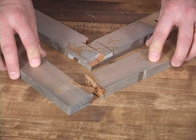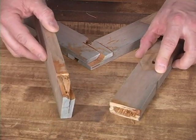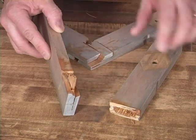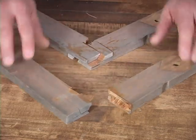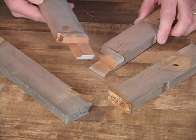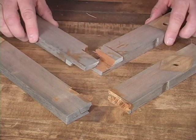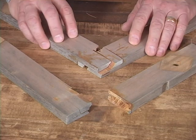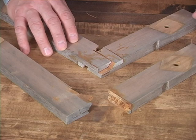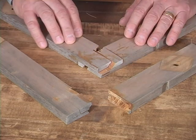Epoxy has been used as an outdoor adhesive for years, and for good reason. As you can see from this mortise and tenon joint, the tenon was pulled halfway out and then snapped off by the strength of the adhesive. On the half lap, wood transferred to both pieces in both large chunks and small layers. Although epoxy tested much higher in the indoor samples than in the outdoor samples, the outdoor samples still had tremendous amounts of strength left.